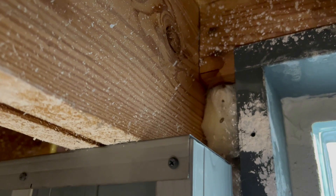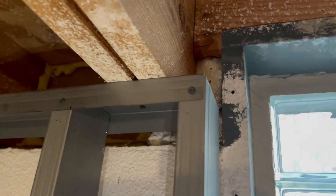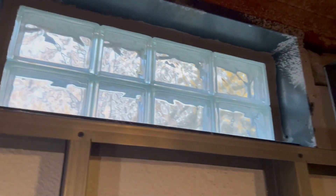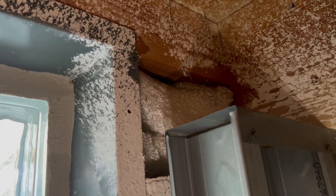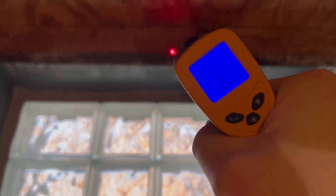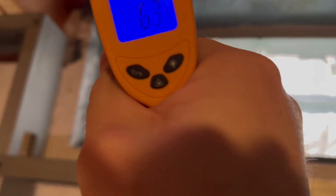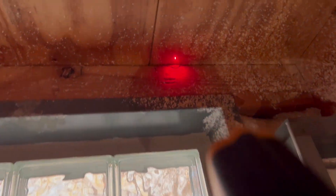I've got a window right here I'm probably going to fill with expanding foam — I have the three-inch big-gap filler, so that'll make a lovely mess like it did for the rim joist. I've got another gap where I might cut a piece of foam board and go around that. Up here above the area where the two wood pieces come together, I think it's sealed — I'm getting 63-64 in the crevice, same temperature. There's some glue oozing out from construction heat adhesive when they put the floor on. I don't think I'm getting any leaks up there.